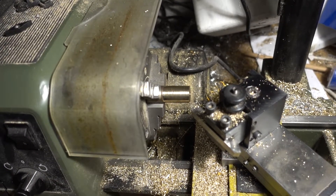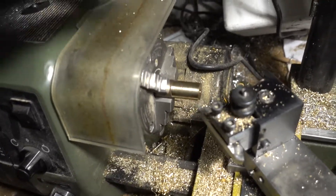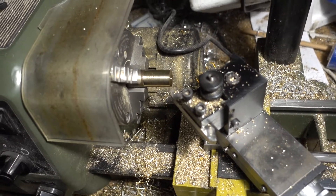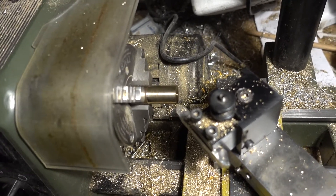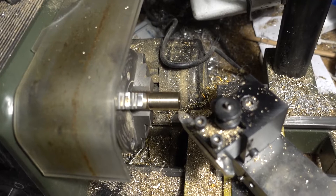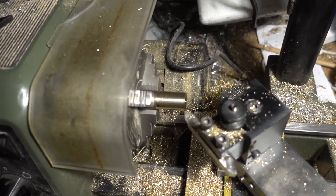I'll have to recast that other part. I'm looking forward to machining that. Now it should be much easier because normal aluminium bronze, even if tuned to the right percentage, is as machinable as steel — mild steel. So it's not the best stuff to machine, but this way it will be much easier to finish that part when I have recast it.